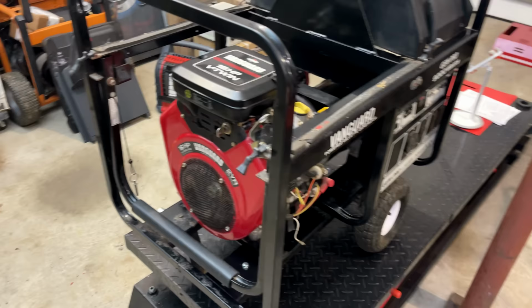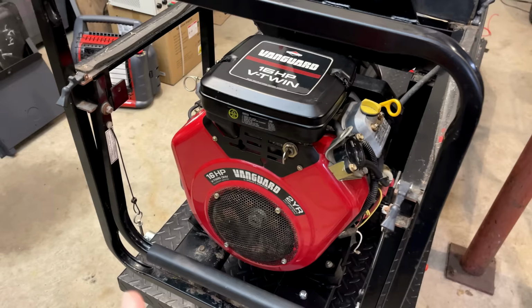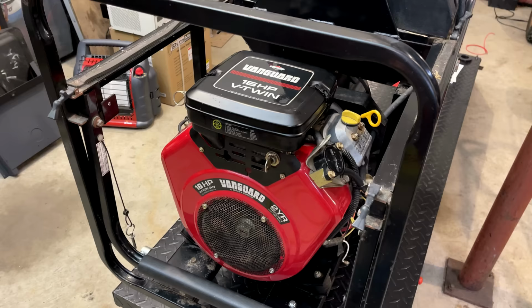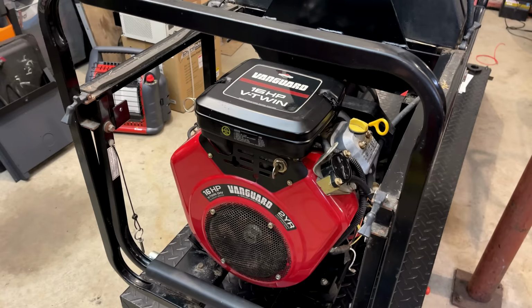And we also have a V-twin engine, so there's going to be a lot less ripple or cavitation than with a single cylinder engine. It only fires once, and then the flywheel actually has to rotate twice before you get a power stroke again. Whereas this one, every revolution you get a power stroke. So that theoretically in itself should make cleaner power.